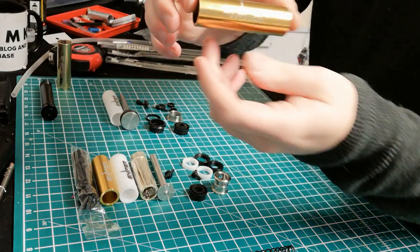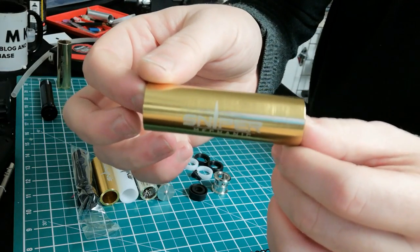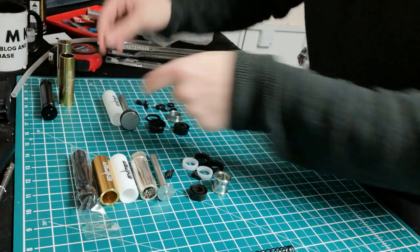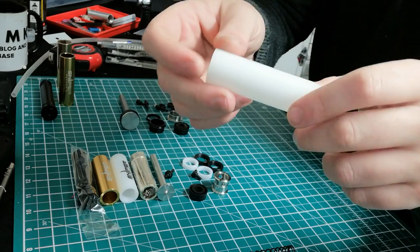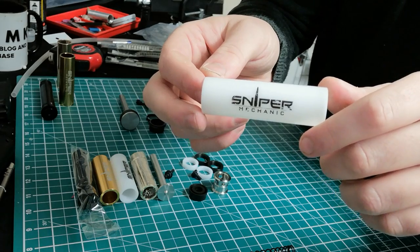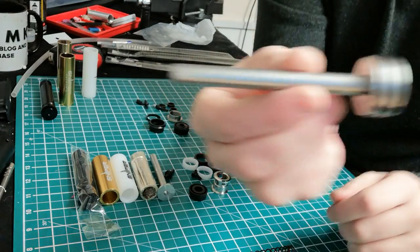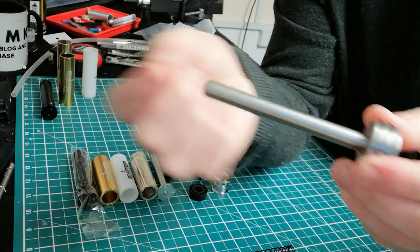Then you get the aluminium sleeve, which is anodised — that is the medium weight one. Then you've got the polymer sleeve. These have something called a silkscreen logo, so the logo isn't as hard wearing on this. This one's been in my rifle and has had easily around 10,000 shots through the testing period. Then you've got your spring guide, which is again one piece SUS304 stainless steel, and obviously polished.